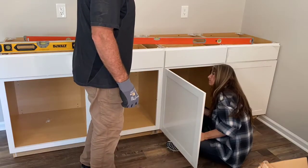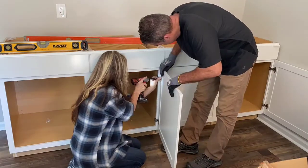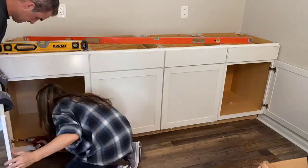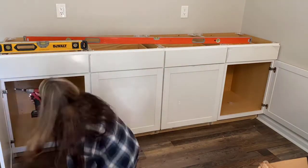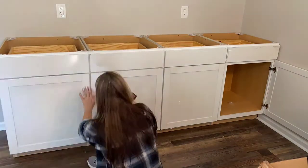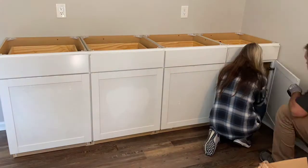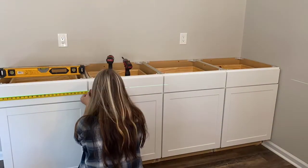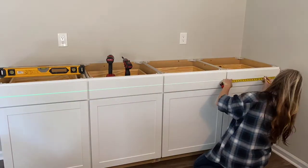And again, we're turning the doors right now for the proper swing. The client wanted the first two sets to face each other and the second two sets to face each other. So it's just a matter of turning those and then readjusting them so that the doors all line up perfectly. And those Arcadia doors do have small adjustments on them so that you can adjust the door up and down, left to right. So right here, I have that Big Max laser.